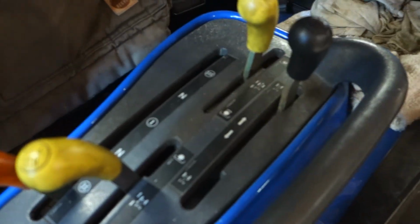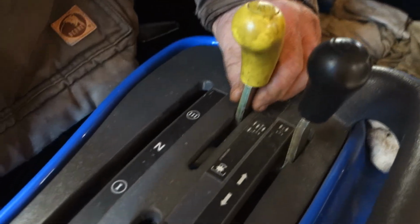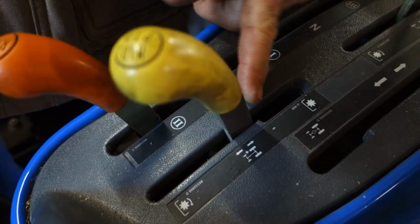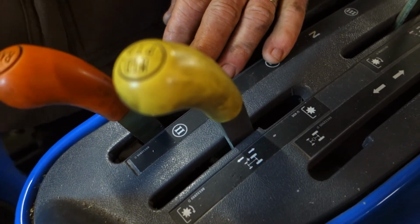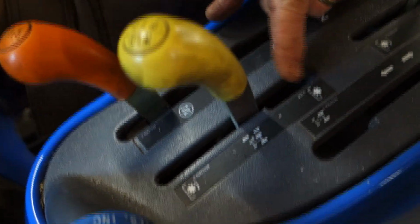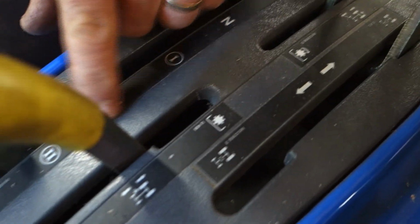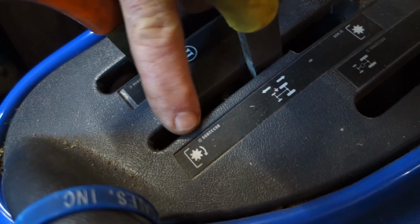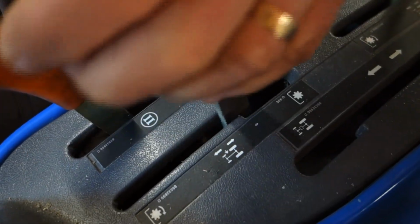Okay, there's two power takeoffs on the tractor. That's the rear one. So when we do our woods mower demonstration, that's that one. But the front power takeoff's here. And that's where you engage that shaft to make it spin. And so you can see on the little diagram, this one gear down here has a little arrow on it to show it rotates. That means live. Normally this should sit back in that notch, it just doesn't.